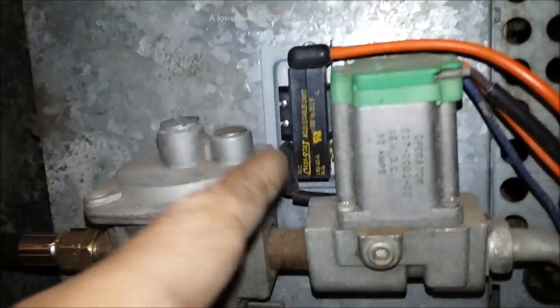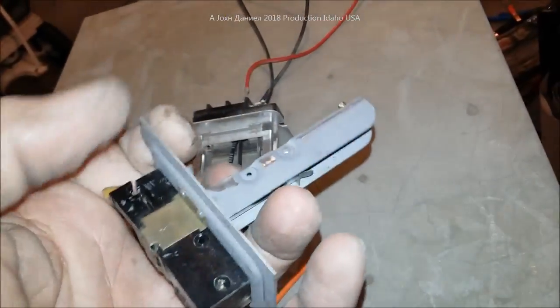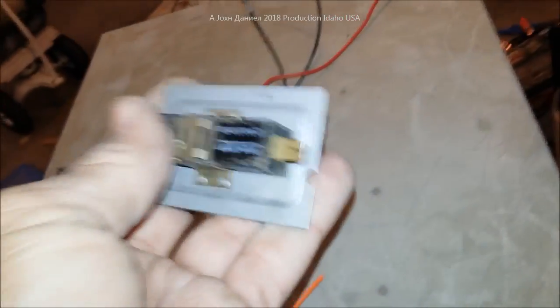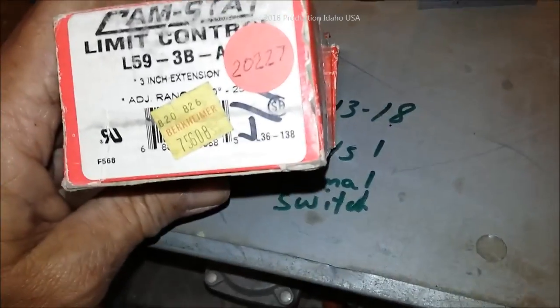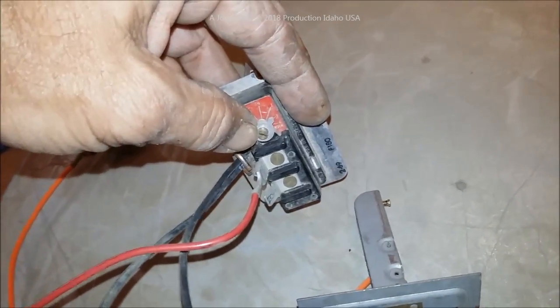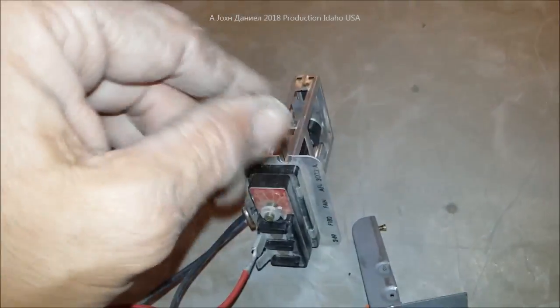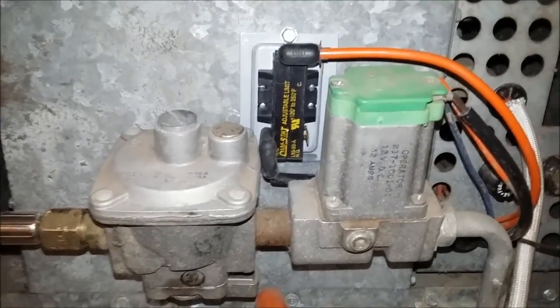Numerous models are available for these, and you can contact the sellers to get the flange measurements. If it doesn't quite fit, there's nothing behind this and you can drill it and put some tiny sheet metal screws in to make just about any model fit. Be realistic — look inside yours and see what you've got. This one is an L59-3B and has a three-inch flange. Some of yours might look just like this with a double safety — this one is a double-safety unit and it's adjustable on the outside for your temperature. This came out of another heating unit that was a Coleman. So if you need any kind of heat fixed, look at that first if it's giving you those symptoms.